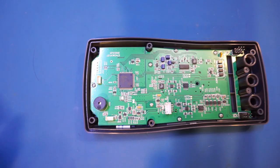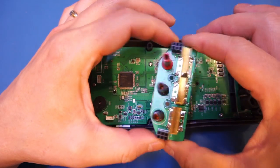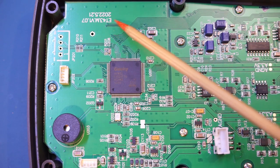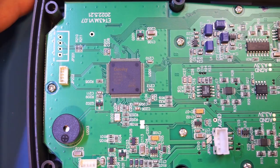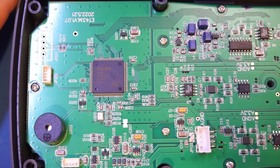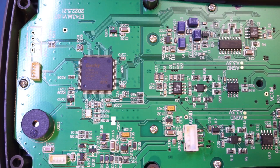I also like the modular design of the circuit boards. There's a riser board pressed onto the main board via two headers, and the input section is nice and neat. One thing that strikes me is the silkscreen on this board reads 'ET43M V1', indicating it is not specific to the ET431. Looking around the board, nothing appears to be missing, which could mean the hardware is essentially the same for all ET430 series models, with differences lying only in software. The overall board layout is very clean — no bodge wires, no patched components.